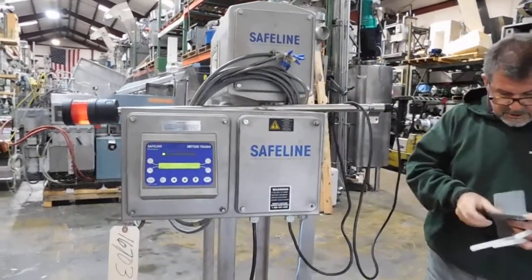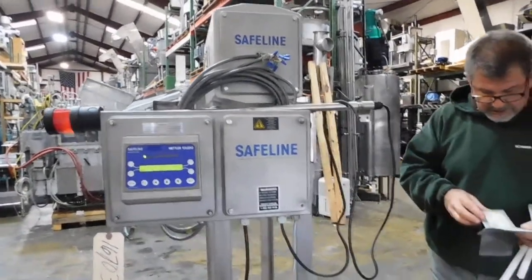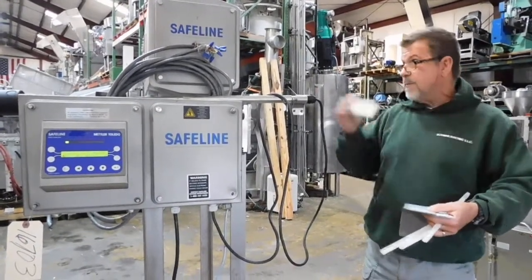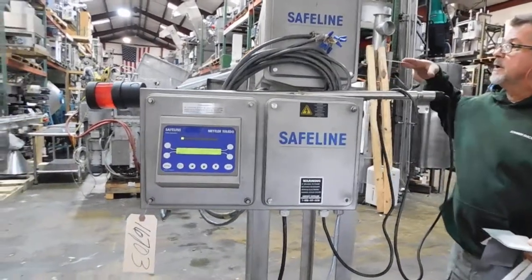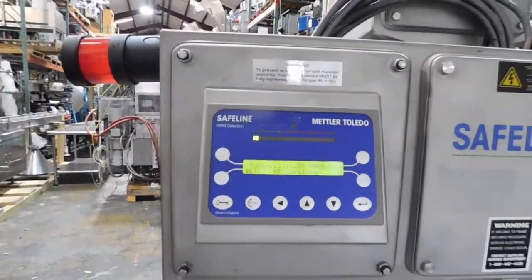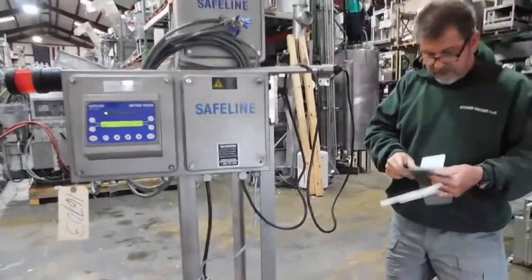We're going to go down and just show you where we find it limiting, because most detectors don't see under 1mm. It's not very practical. Here's a 1mm ferrous sample. And you see it doesn't actually see that. It does get a slight indication when I push it all the way in, but it's just at the limit. So we found the minimum to be about 1.2mm.